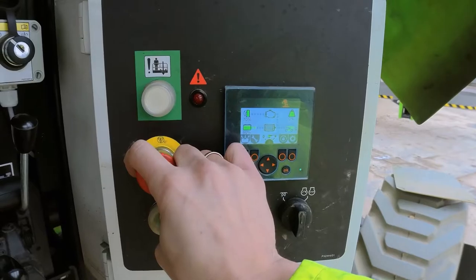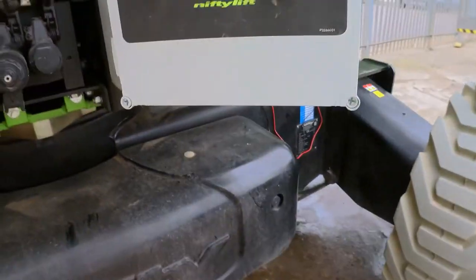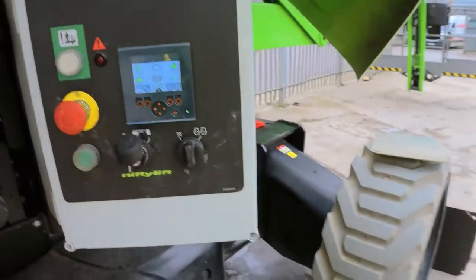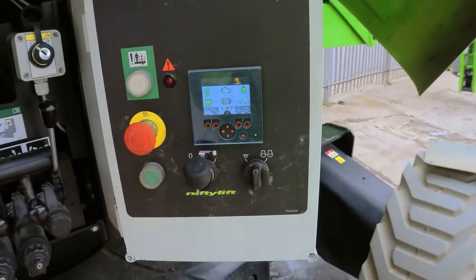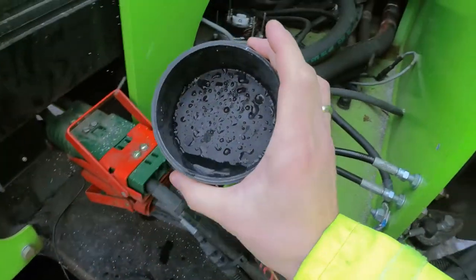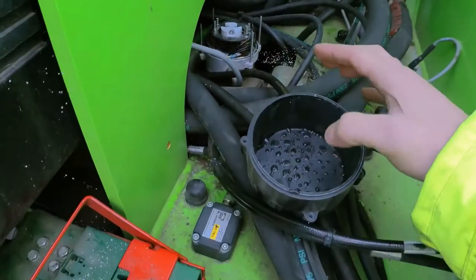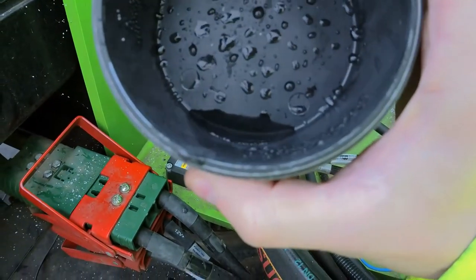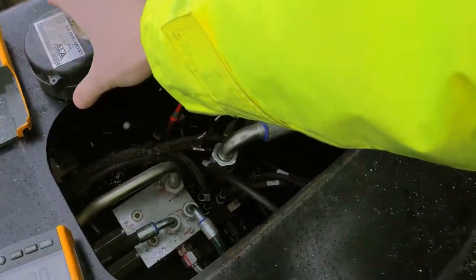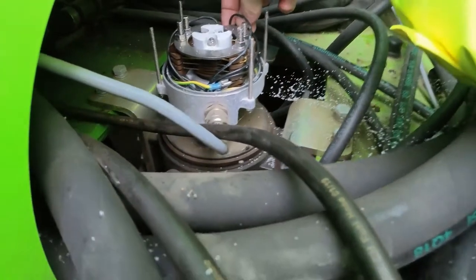Press the green button - the motor runs. So the problem is actually with the swivel joint. I'll go up on the links to take the top cover off the connector on that swivel joint. I've just removed the cover from the swivel joint - going up on the secondary boom there is a dead rotator here inside, and as you can see a lot of water in it. That explains why we have the problems with the contacts and no good connection on that number 4.